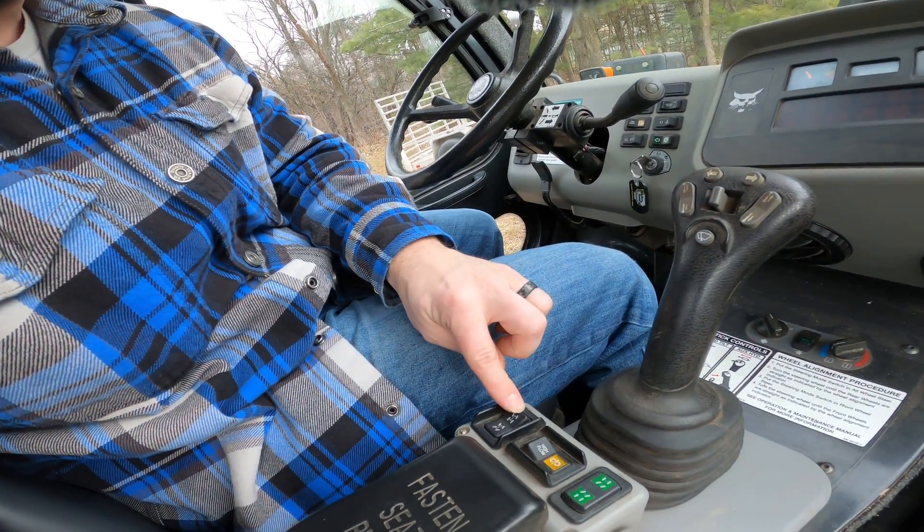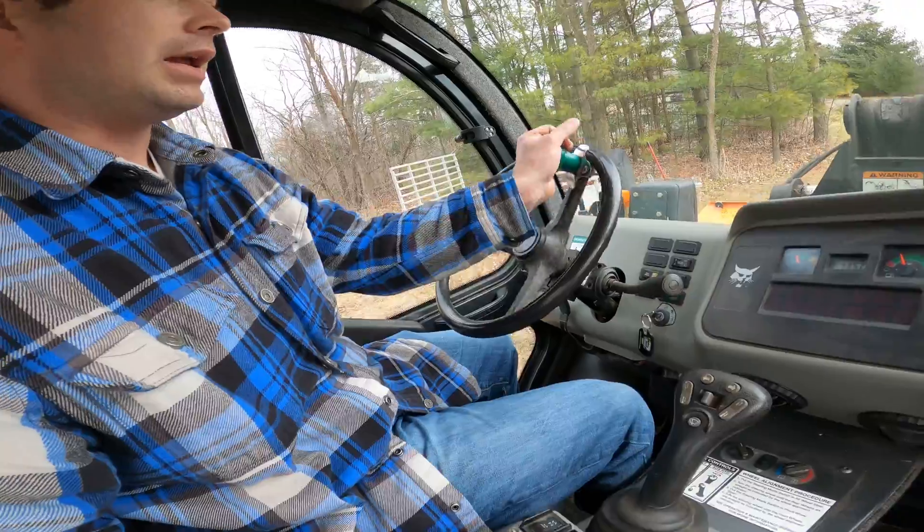Once locked into front steer only, your front will steer but your rear stays at an angle, so you drive diagonally — sideways down something. This is great if you want your implement to be further away from the road or surface you're driving on. Or if you're getting stuck somewhere, up against trees — especially with four-wheel steering, you need a turning radius around you. The crab steer is great if you find yourself in a predicament, up against a wall or parking in a garage. It allows you to steer and pull away from an obstacle without swinging either the front or rear end at it. That's a quick demo — let me show you an overhead of how it drives diagonally.